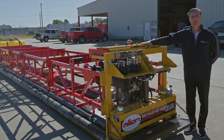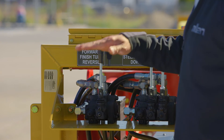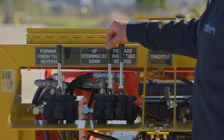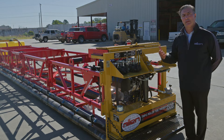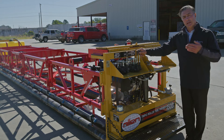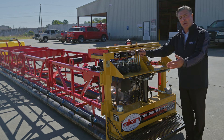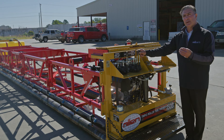This is the operating console for the 150B. This is the control valve lever for the leading tube, which is going to screed your surface to grade, and this is going to operate in a clockwise manner. This is the lever for the steering leg. The steering leg is below the machine and allows you to raise up one end of the machine to square the machine. This is the forward travel control valve lever, which allows you to move the machine forward or reverse. Typically during a paving application, you will advance forward, take the machine back, screed a second time, and there may be an opportunity to pave a third or fourth time, depending on the porosity of your material, the size of the aggregate, and the slump that you have.